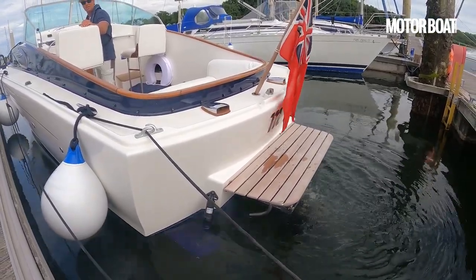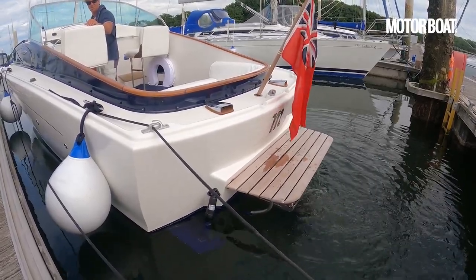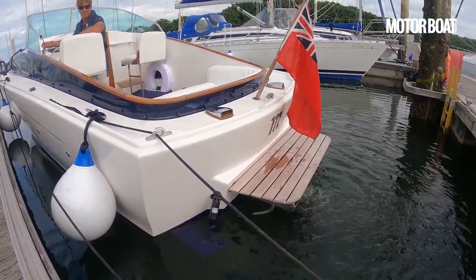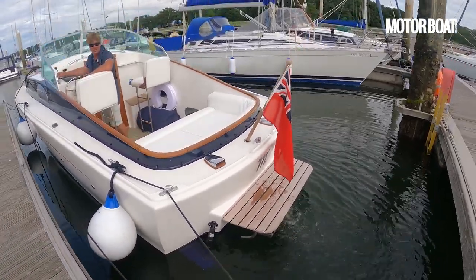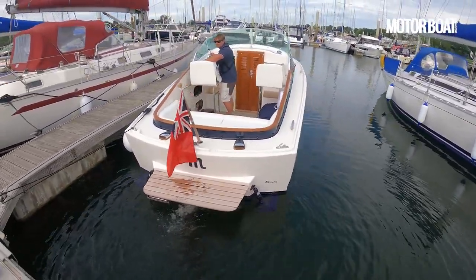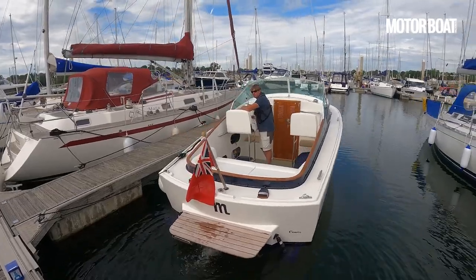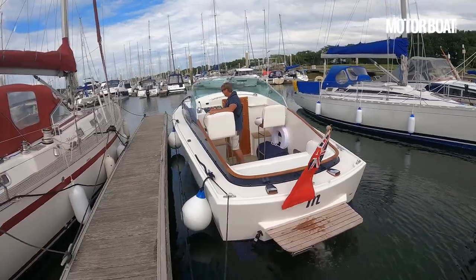You can see a little bit of smoke here because this was originally fitted with twin petrol engines, but it's been re-engined with a single 180 horsepower Mercruiser VM diesel. With this big single diesel it's more efficient through the water, actually a little bit quicker, so you should get speeds of up to around 27 knots. But it's not really about flat out speed - it's about how it runs through the water.